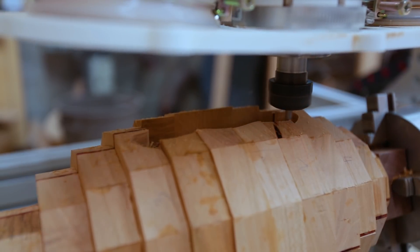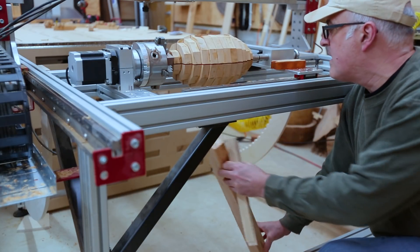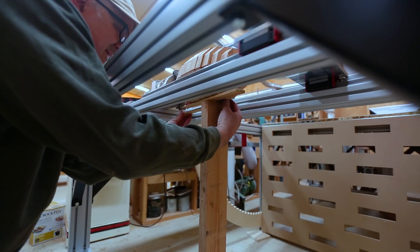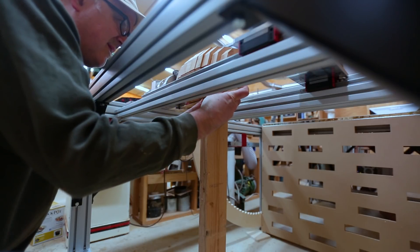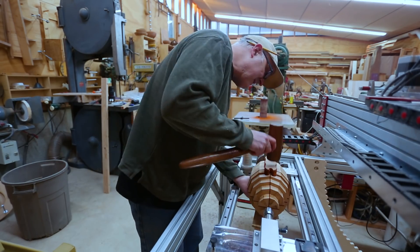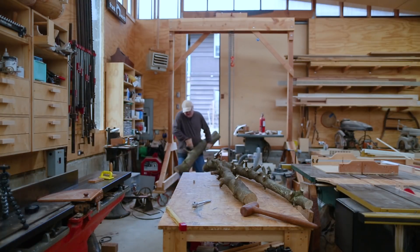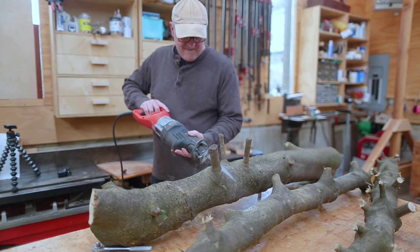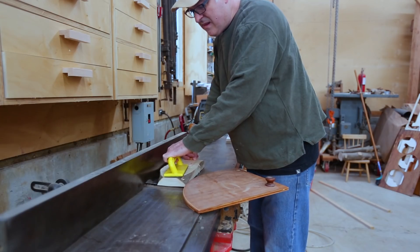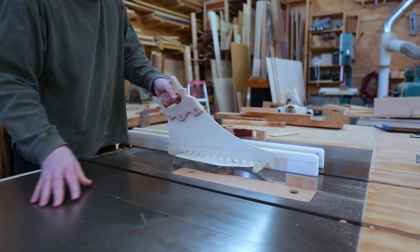This is what that finishing pass should look like — just taking off a few thousandths of an inch. Because I wanted to do more cutting on this location, I didn't want to move the football, so I put some support under it and worked on it in place without risking damage to the lathe, chuck, or tailstock. For the stitching, I got some holly last spring from a neighbor. It's down to about 10% moisture content, which is a little wet, but I'm using such small pieces I think it'll be okay. The nice thing about holly is it's really white — it'll work well for the stitching on the football.